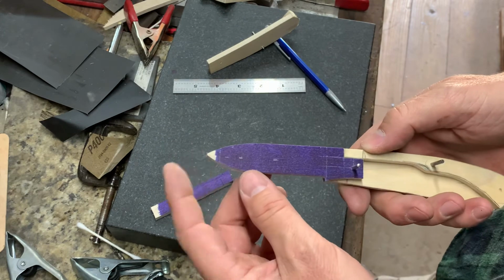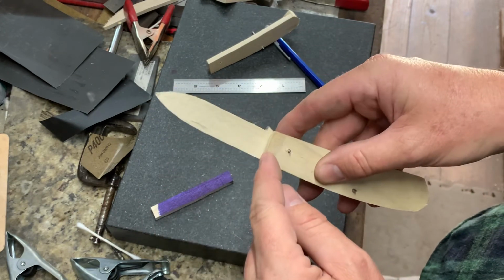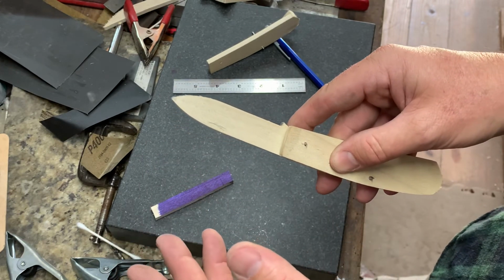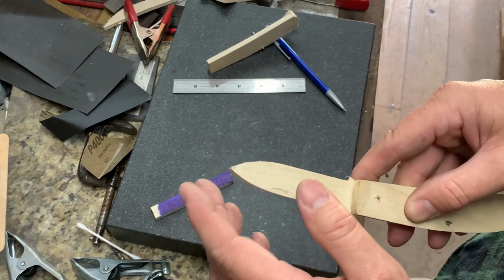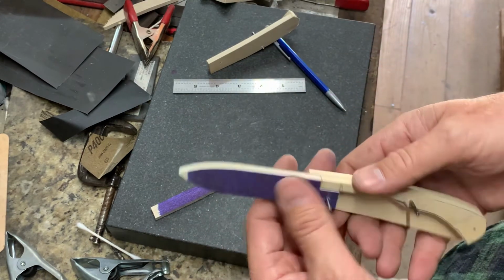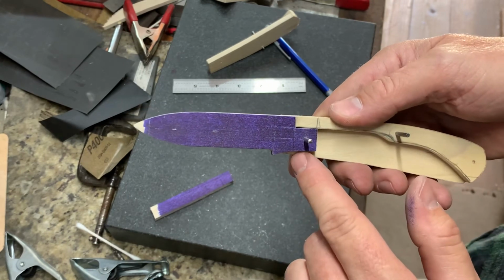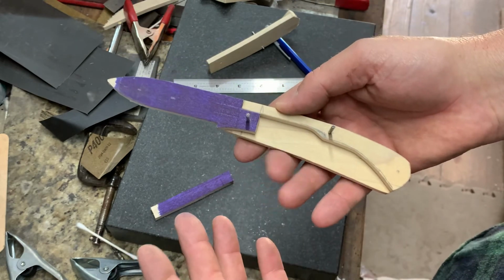And I measured the blade right now from the front of the handle to the tip. You're looking at 3 1/8 inch. Of course, depending on where somebody was, that could be modified a little shorter, a little longer. But using the 1/3, 2/3 method, you can lay out your design. And again, it took me about an hour to do all this today.